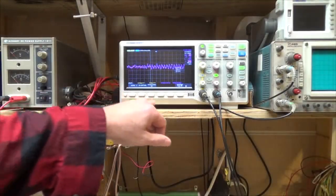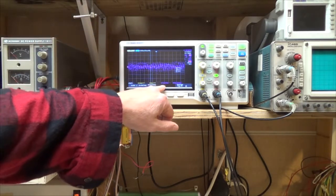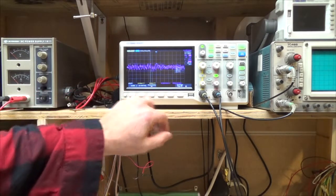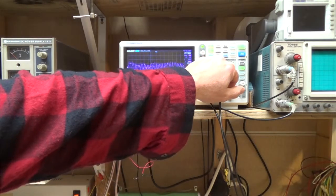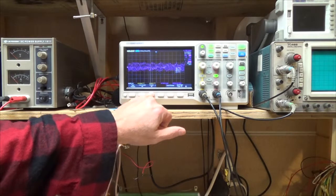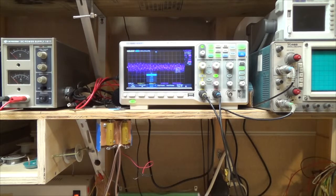So I'm just playing a record here. I just wanted to see what the voltage coming out of the ceramic cartridge head is. And looks like it... Hold on, let me just let the scope persist it. So it looks like it gets as high as like a volt and a half peak to peak.